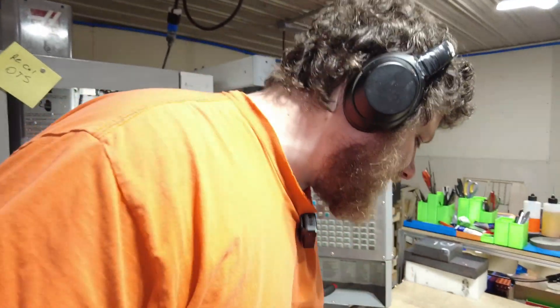In terms of tooling for cutting acrylic, polycarbonate, or any plastic, I don't think you need to buy plastic-specific tools — they exist but I rarely use them. Most of the time I grab a tool designed for aluminum that's brand new and has never been used, and use that in plastic. The plastic will basically never dull your tool unless the material has inclusions like fiberglass or carbon fiber fill, so you can just put the tools back in your drawer for when you go back to aluminum.